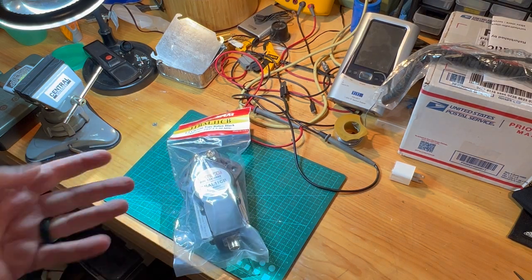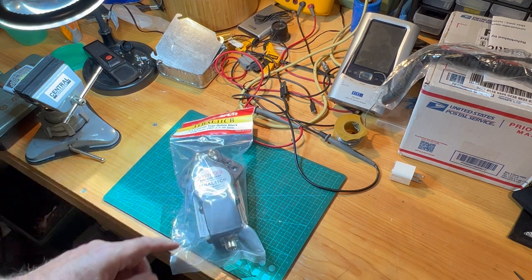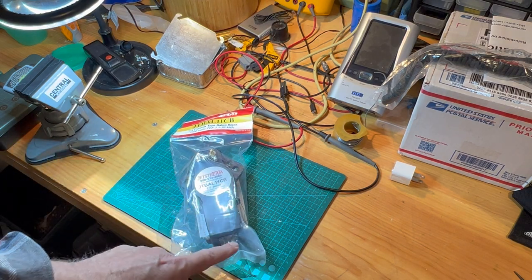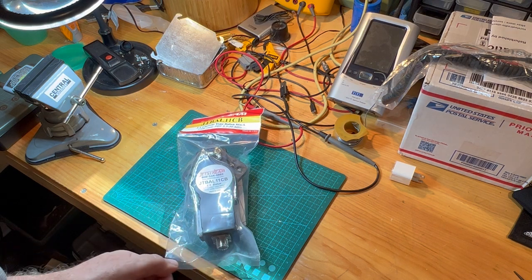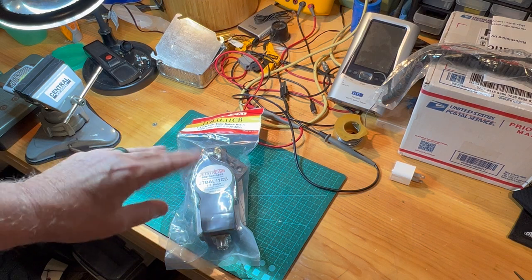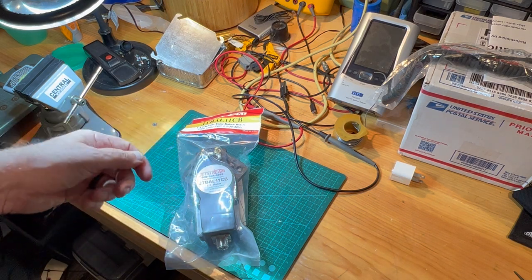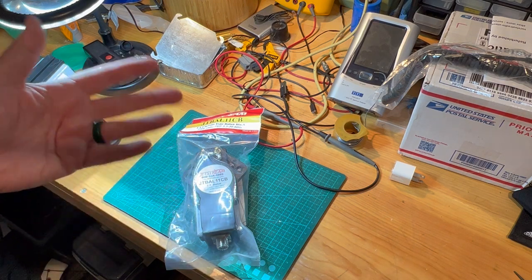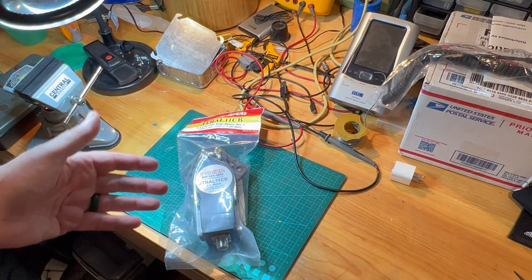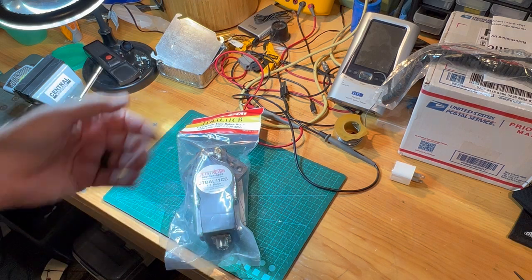Let's look at the components that are going to go into making this antenna. First thing we'll take a look at is the common point of the antenna. The two legs of the antenna would connect here. There's an incorporated one-to-one balun inside, and there is an SO239, making it easier to connect everything together. In the old days, I would just solder the coax onto each leg, wrap a couple of loops around the center egg insulator, and that was sort of the matching unit. But now we're doing it this way.